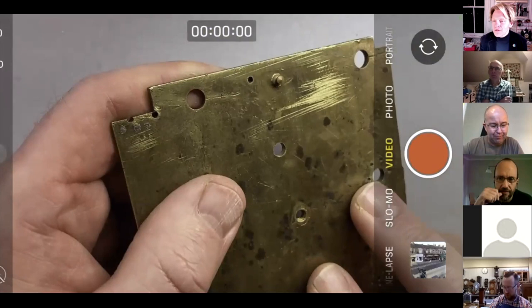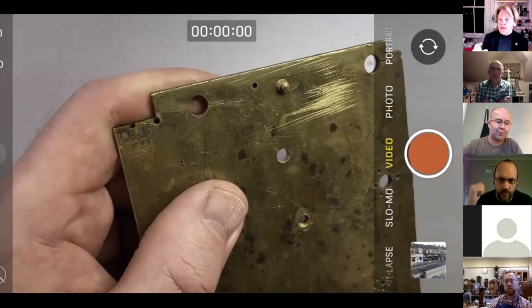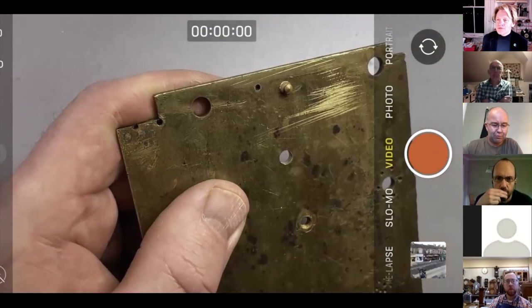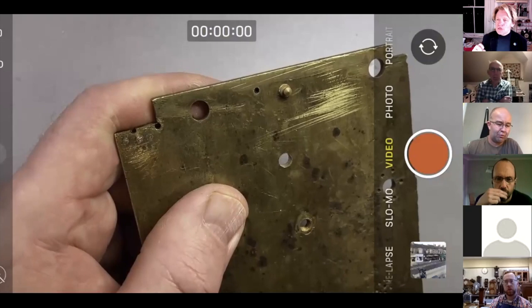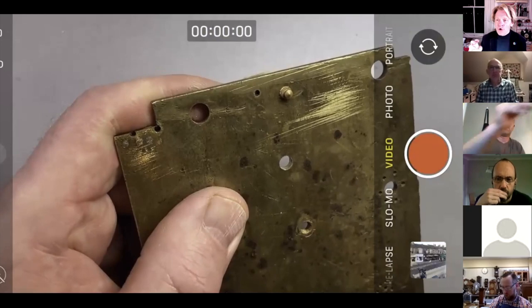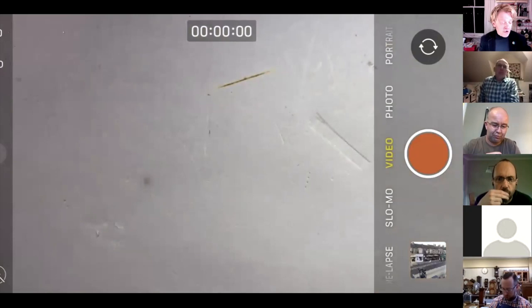Does that affect the ability of that thing to stay in the hole? Yeah, it probably does, Rob. Ideally you want as much interface between the two components as possible. Ideally, you'd make them new, but you may have been in that situation. I've certainly been there with a wheel when you make the collet a bit too small. We're talking about a tiny bit. You can get yourself out of the pickle by making that hole a little bit smaller with the broach, or, as you can see here, making the component a little bit bigger. In the case of a wheel, you're going to rivet that thing anyway, so it's really about concentricity.